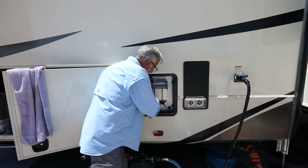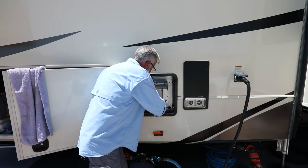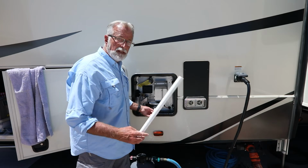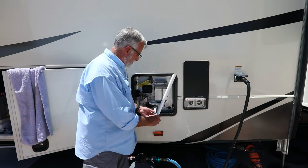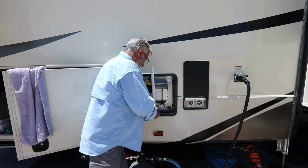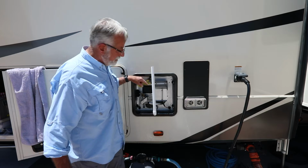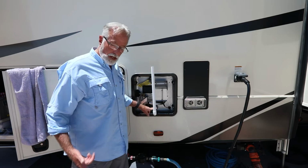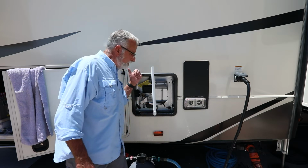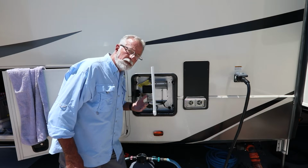With vinegar, and I could do it by pumping it through the Nautilus system, but this is just going to be done tight. I'm going to use this and a funnel. That way I know just about exactly where this tank is when it's full. And you can do this on any system, whether it's Atwood or Dometic or whoever it is, if you don't have a Nautilus. So we'll do this so that it kind of covers a little bit of everybody.